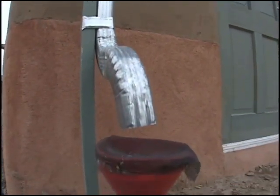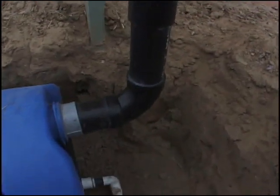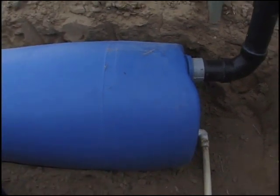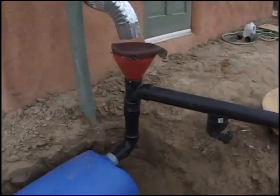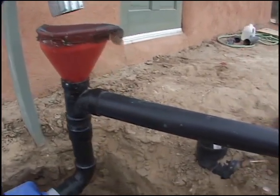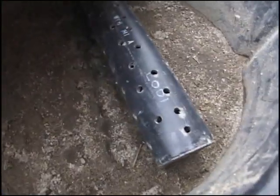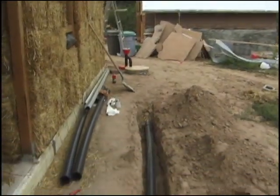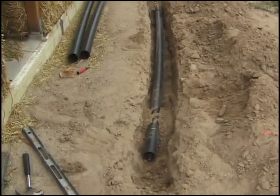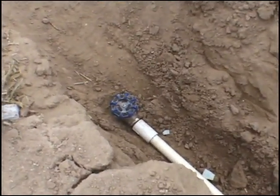The first few gallons of water coming off the roof is what is most heavily contaminated — it has dirt, bird droppings, leaves, whatever. So the first few gallons you want to throw away so only the cleanest water goes into the cistern. This is accomplished by using what is called a roof washer. In this case, we're using a buried small tank that takes the first few gallons of water off the roof and eliminates that from the cistern. The water slowly fills up this tank, backs up the pipe, and only then does it start to flow into a simple sand filter. It is deposited into the filter through a perforated pipe to distribute heavy loads of water during a downpour. Then it filters and trickles through the sand, is collected by another pipe at the bottom of this small tank, and is then taken to the cistern. A drain line is connected to the roof washer so that the contaminated water can be drained off — you just open up the spigot a little bit and it slowly seeps out, then resets itself for the next storm.